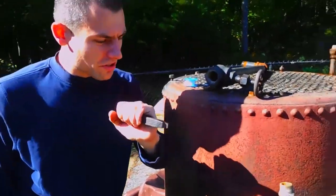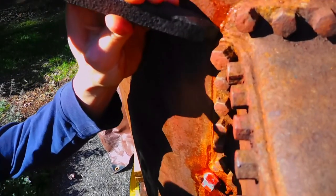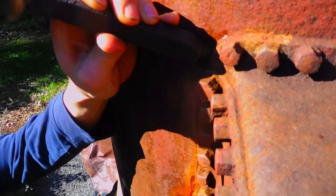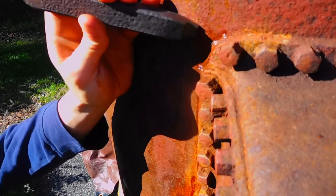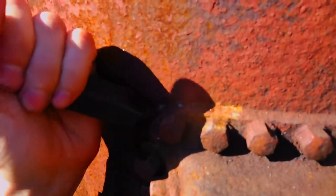Caulking iron — I made it myself. This is how you deal with seams that have come undone, as it were. Caulking is the procedure to seal up a boiler when you first build it and in subsequent repairs. We're just going to keep going until we slow these leaks to a stop.